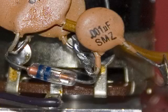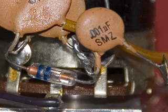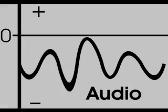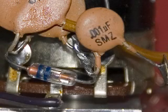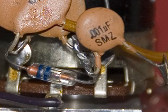So that's where the diode comes in. Another way to think of it: it is a portable detector. What it does is cut the signal in half. Now the energy does not add up to zero, and an audio amplifier can amplify that. With this portable detector, you would be able to trace the RF signal through the front end of the AM radio.